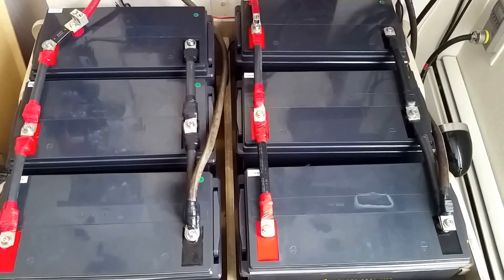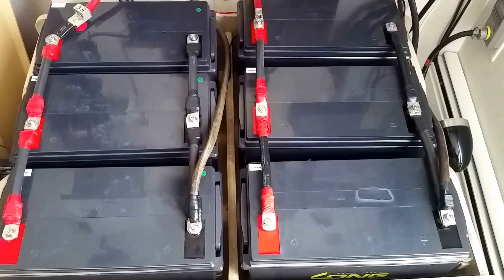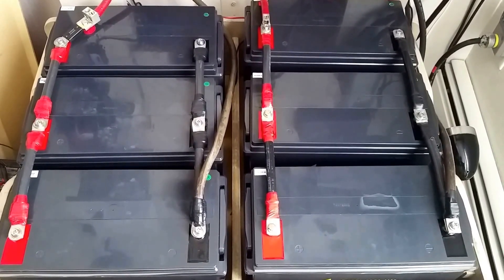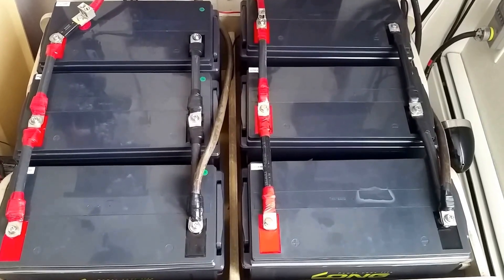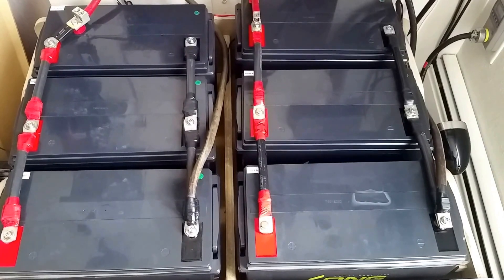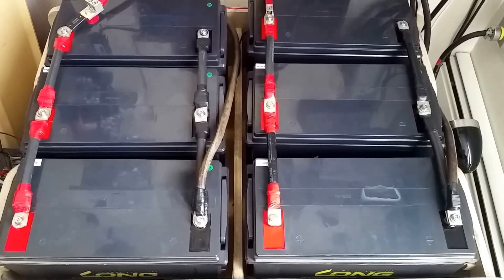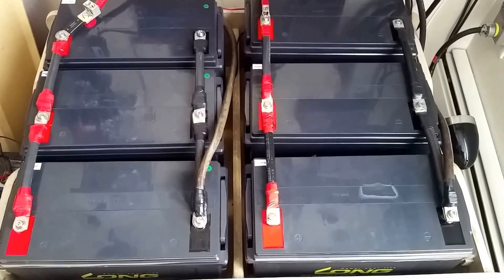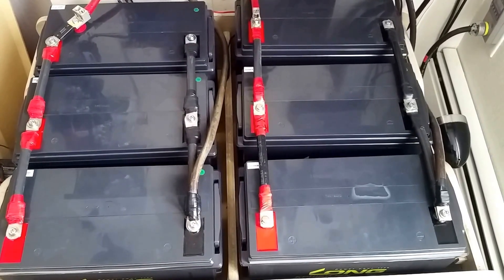Here in Minnesota the weather is crazy. When I have plenty of sun, I keep it on 12 volts and double up the amperage on the panels. A 900 amp hour battery bank is not easy to charge, my friends and fellow subscribers. Having a 24 volt system would be harder because if one panel is covered it reduces efficiency. But on parallel, if one is covered the others are still active and can still produce power.